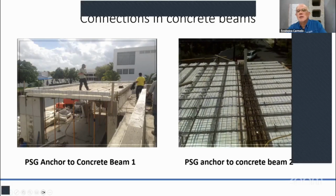They did additional reinforcement. And you can see the PSG panels, where this would be the U going down. This is where you're going to have your 2 rebars going down, and they use these 3/8 inch U's so that it doesn't touch the bottom. It's kind of like your chair at the bottom of that foam. So you have 2 1/2 inch rebars, plus negative rebar on the top that they added. And again, this was a design by a structural engineer or an architect.